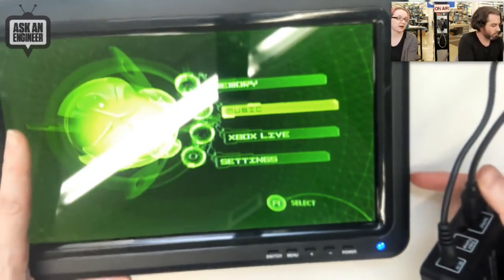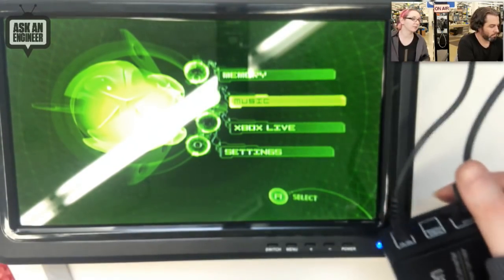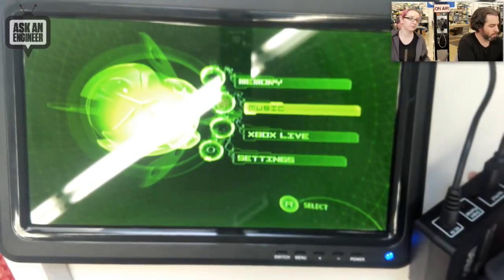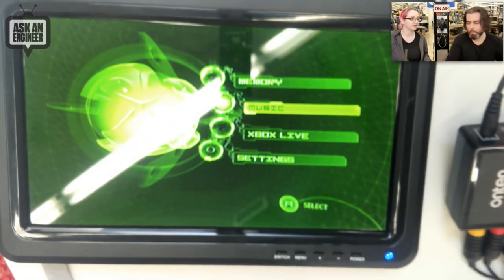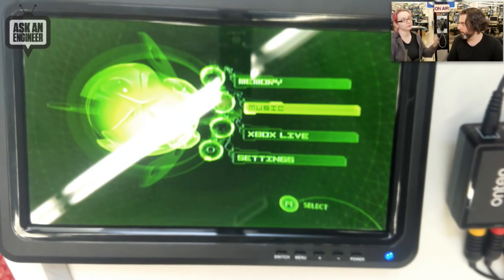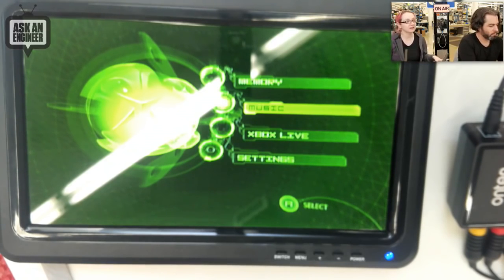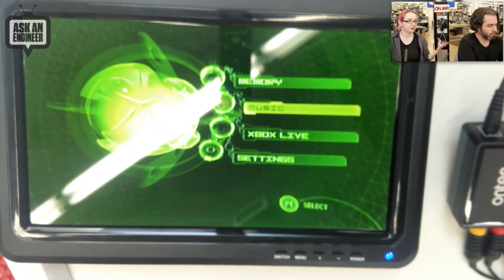So like this is a monitor that has video and audio, so you could hear when I was booting it up, the speakers were playing the audio. You also get the audio out from the little port over here if you're using a monitor that doesn't have speakers. And then you can select the output format to 720p or 1080p. So these are more expensive than the ones we have the other way. We have a converter that takes HDMI and decodes it and gives you composite. That's really easy. It's way harder to take composite and audio and convert it into HDMI.